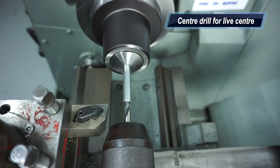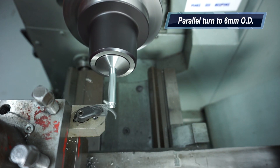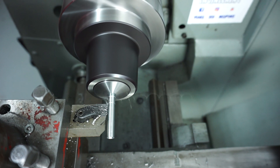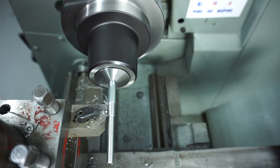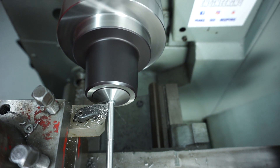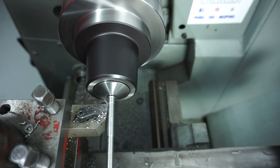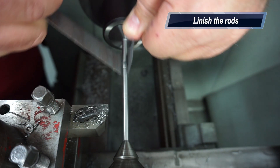You can see here that I just chased these up. I split the rod into three sections to eliminate flex when machining — as you know, when you start to machine small diameters over any sort of length, they obviously want to distort or warp and you end up with conical shapes. Once I got it down to size I was aiming for 6mm, but it wasn't critical — it came out 6.05, and that's fine, it's not going to worry me. These are purely to hold the cylinder head on.